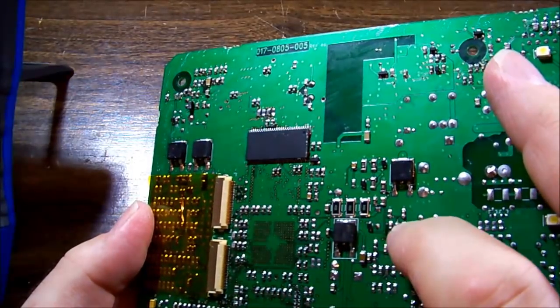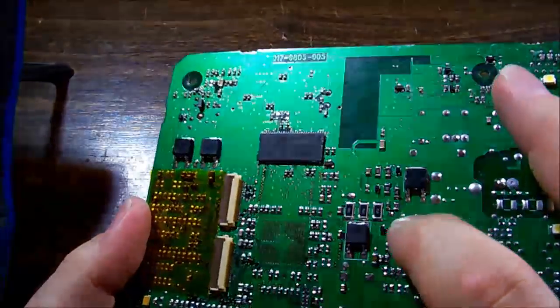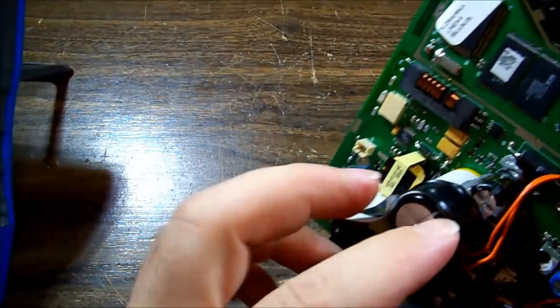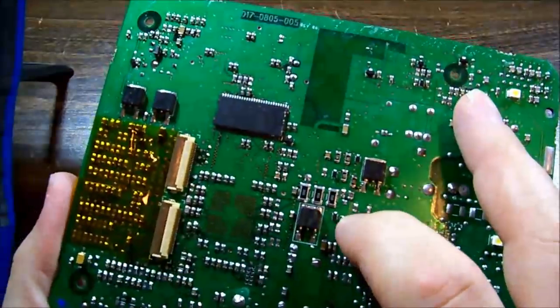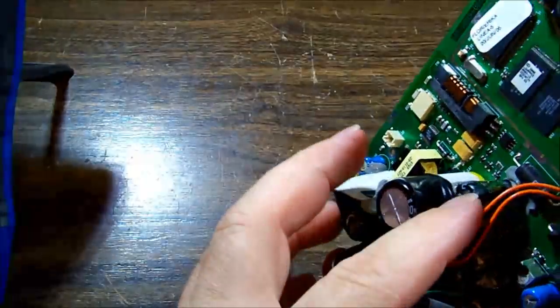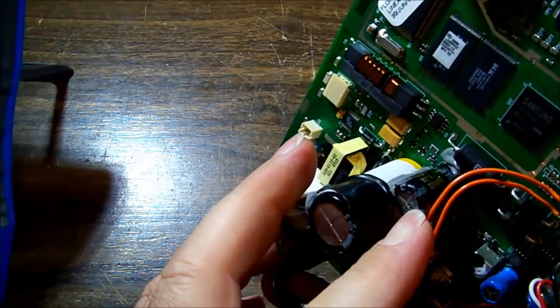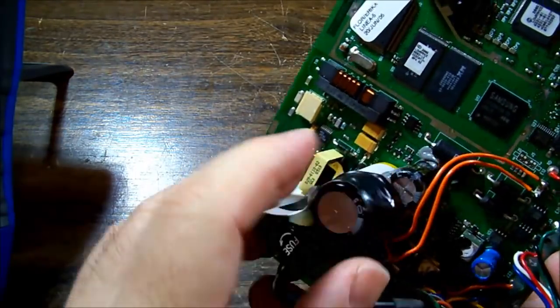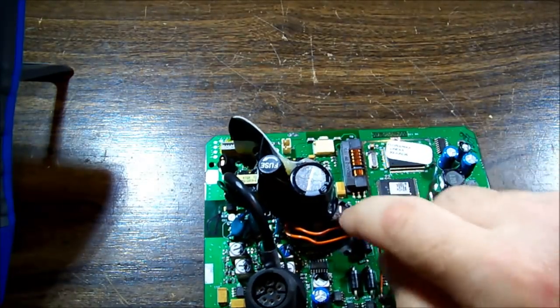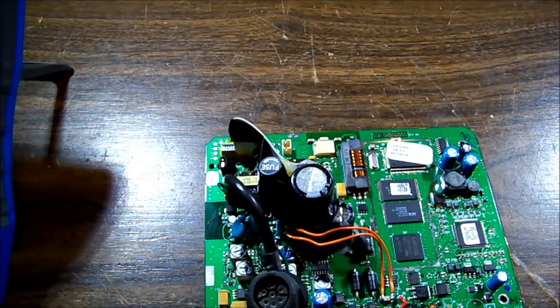Oh no, there could be a pin sticking through there. What's that? Oh, that's that. Is that the cap? Yeah. There's a cap, input cap there. So it goes to there, and then I guarantee you there'll be a trace under that cap. So we're going to have to take the cap off to find out where everything's going. But we'll measure across the cap as well and just see what resistance is there.